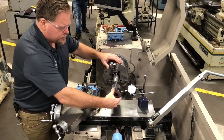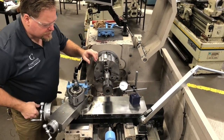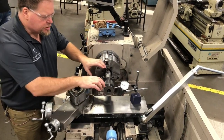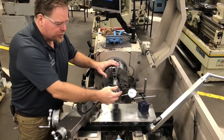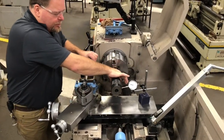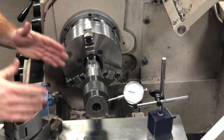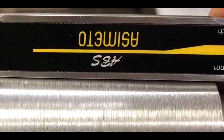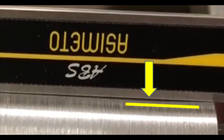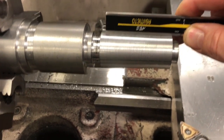I'm putting this taper socket on very gently — not forcing it, just pushing it on. The indicator is up against the piece. To check the fit, normally I would just grab it and jiggle it, but on camera you can't see fit, so I put an indicator up against it and try to jiggle it back and forth. Just by pulling on it it makes the part move — there's like no play in this at all, so this was a really good setup. It is extremely difficult to see without putting a straight edge onto your work piece. What happens is it makes the checking fixture jiggle when you put it on if it doesn't sit flat, and it can also be something like burrs on the surface.